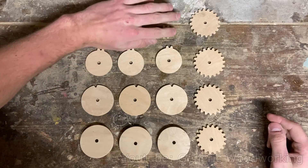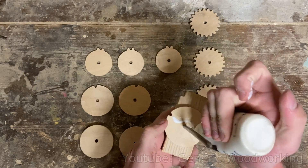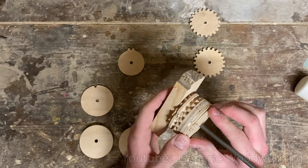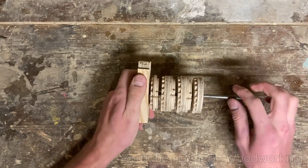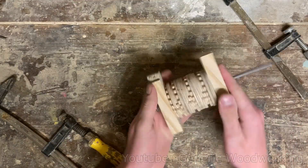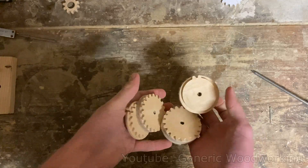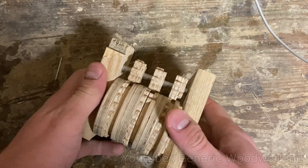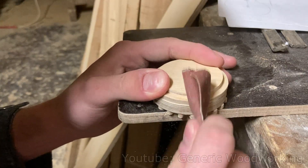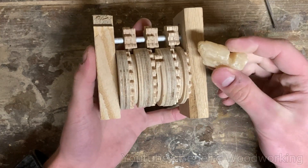I finished making most of the pieces and now I'll just glue them into three separate sets. So apparently there were actually four sets of pieces, and the fact that they all have a hole through them makes it very convenient to clamp them. I made a little testing jig, but it doesn't really work yet because there's way too much friction between these teeth. So I'll have to sand everything to make it work. It's a little bit smoother now, and I'll also lubricate this with wax, which should help a lot.